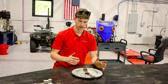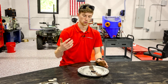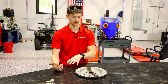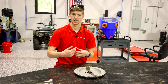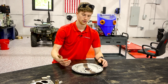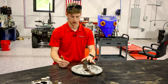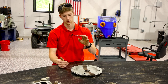I think wet blasting honestly yields a better looking result. With wet blasting you do have to worry about surface rust or corrosion after blasting — we do have a corrosion inhibitor you can put in your machines that prevents all that. It's not as much of a worry with dry blasting because you're actually drying that part off as you're blasting it. These results are very comparable; it comes down to what you're wanting to do.